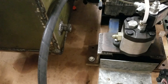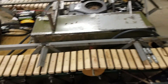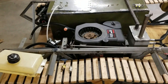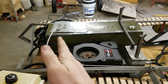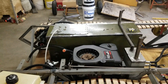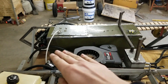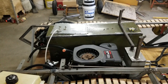Another thing I was thinking about with the reservoir is that when the tank is going up or down hills, the fluid in the reservoir is going to shift side to side. When the tank goes up a hill, the fluid moves back — that's not a problem. But if the tank is going down a hill and the fluid goes to the front and the level drops below the outlet, the pump is going to start sucking in air, probably cavitate, and ruin the pump — which would be very bad.